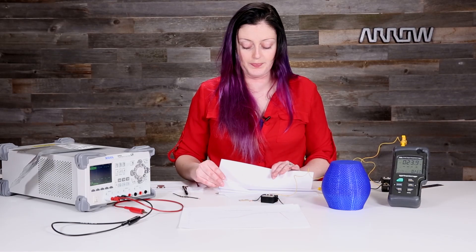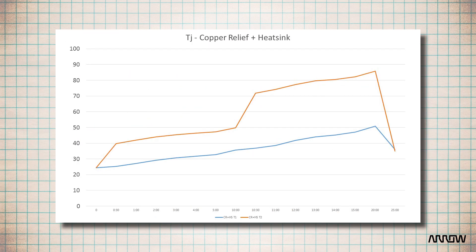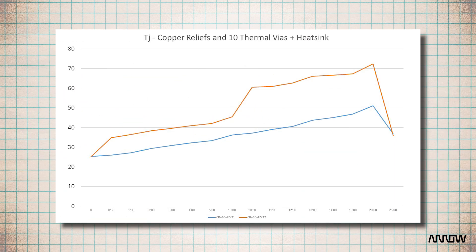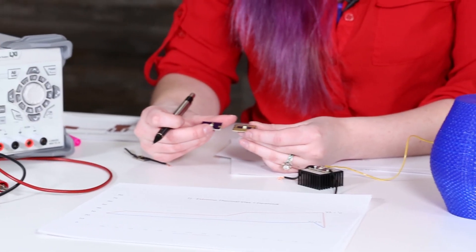Even with heat sinking, the rookie board was still kind of a disaster — it still got up well over the 150-degree junction temperature, hitting 194 degrees. When you heat sink the other ones, they do much better. With the copper relief — the bare minimum I would consider — it reached 85 degrees. The rule of thumb board came in at 72 degrees. That is about as great as we're going to get — certainly not going to burn you or set fire to your table the way that 300 degrees did. The extreme thermal via situation performed a little bit worse, topping out at 73 degrees. The temperature in the room could have gone up a degree — these two boards perform almost exactly the same way, which is absolutely fantastic to know. This is overkill, kind of looks dumb, and prevents you from writing anything in your silk screen. Stick with the nine-via rule-of-thumb design.